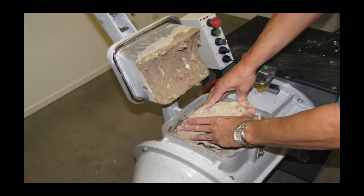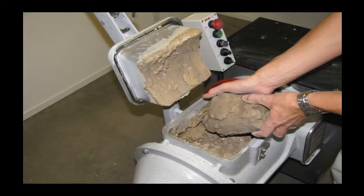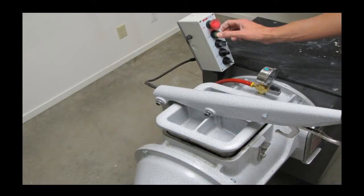The Peter Pugger was designed to accommodate overfilling of the pugmill. Anytime the Peter Pugger is overfilled, excess clay oozes into the vacuum chamber, where the clay can be collected and placed back into the processing chamber. A simple test to confirm effective mixing is to mix with the handle latch unlocked. If the door rises and shuts the safety interlock off, this confirms that proper mixing is taking place. If the door does not rise, add more clay.